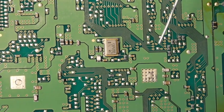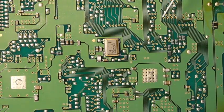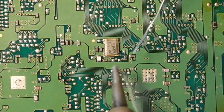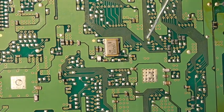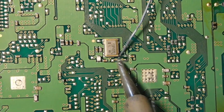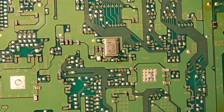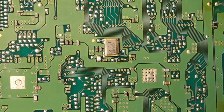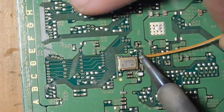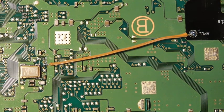One of the last things we're going to have to do is tap into the clock signal — so this is the crystal oscillator right over here. We're going to start by just getting rid of this little surface mount resistor here — just put some solder on both sides and it'll come right off. Then we're going to tin this little test point right here. The final thing is to take a wire, solder it to that test point, and the other end goes to a pad on the QSB. All right, that's the last little connection and I think we're basically good to go.